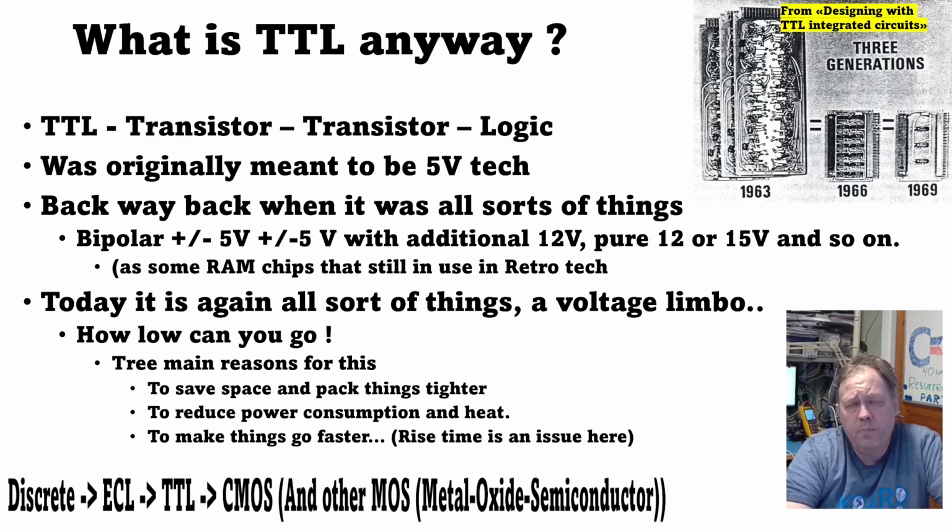And today most of these chips are actually made of MOS technology, not TTL at all, even though they have remained compatible. And they replaced earlier logic. It was really a change in design, because earlier logic did not have a standard that defined a positive high 5 volt signal, or that 0 was 0 volt or something similar. ECL had this turned upside down, and CMOS luckily regained the levels from the MOS. But the original CMOS was a higher voltage series than TTL, and used from about 0 to 12 or maximum 15 volts or something.